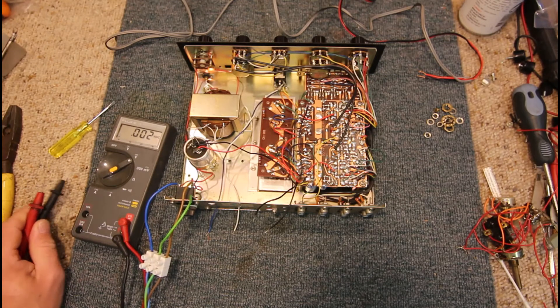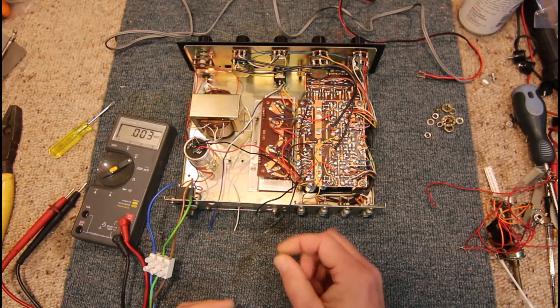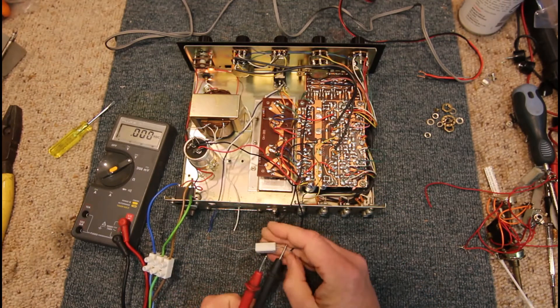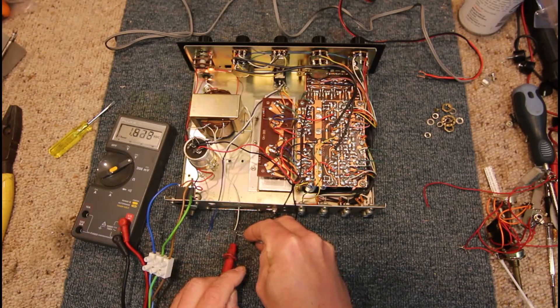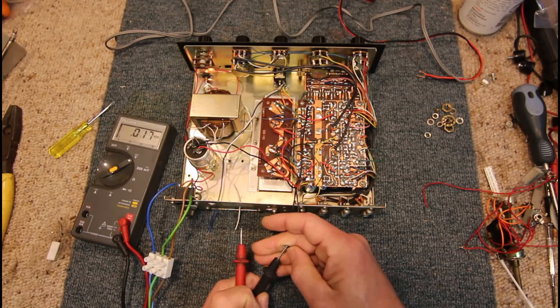It may blow something in the amp if there's a DC problem, so it might be better to go even higher resistance — maybe 100 ohm 5 watt to ground temporarily and see if that drops the voltage. That's probably the safer way. Yeah, it seems to be discharging, so that might be okay. Sometimes you normally don't have capacitors on the output of these amps, but because this is an old one with output transformers, they're set up quite differently. It seems to drop down slowly to zero volts, so that's probably just the caps charging up at initial startup.